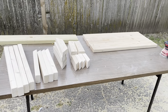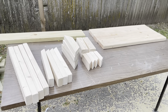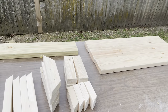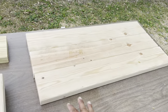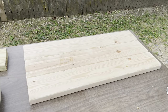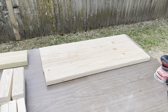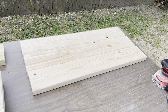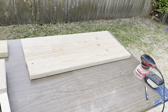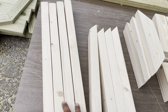In this video we're going to be taking a look at making a small farmhouse laptop desk. I'll go over the parts that we need. We're going to need four pieces of two by six that are 36 inches long. Your desk may vary from that dimension depending on how long you want to make it — in my case I'm making a 36 inch long desk. Then we're going to need four pieces that are 24 inches.